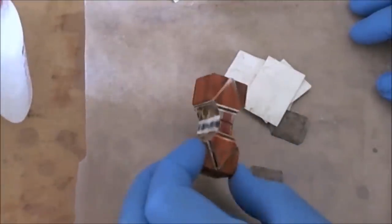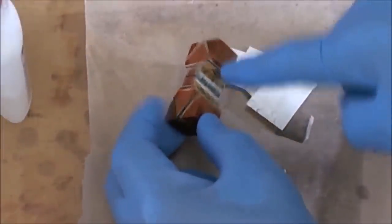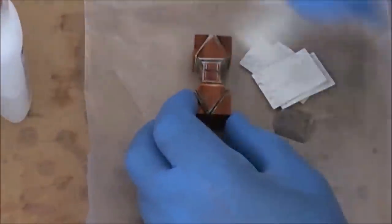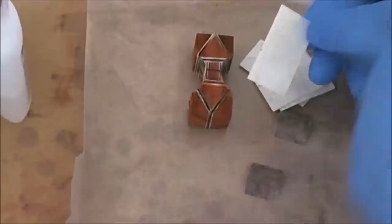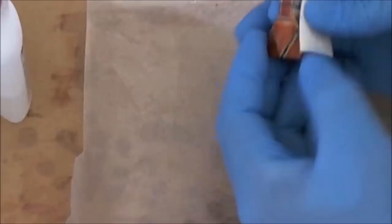Okay, so we're getting ready to glue the medallions on the side. In the picture, it looks like it goes straight through from one end and comes out the other, but it doesn't. Now, earlier I had mentioned, this is a piece of straight grained veneer, so the grain is running horizontally with it. So if you try and put that in here and then try and bend that, you can see that it's not going to bend. It bends a little bit, but it's going to break. See, it's already splitting. You do that with 3 pieces and you're not going to have any luck trying to get that in there. All it's going to do is bounce back on you.